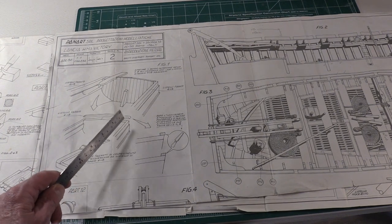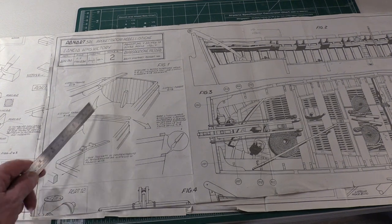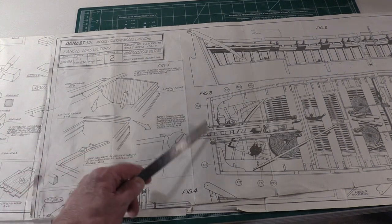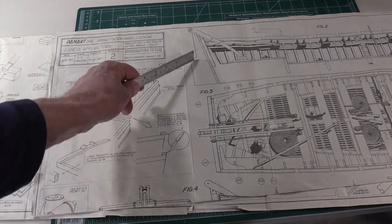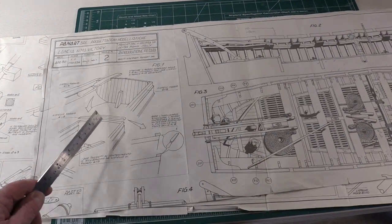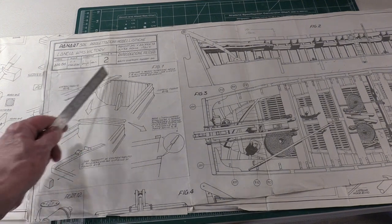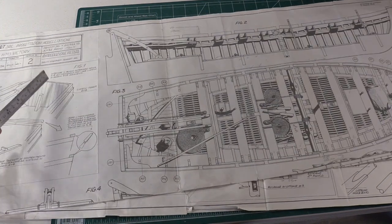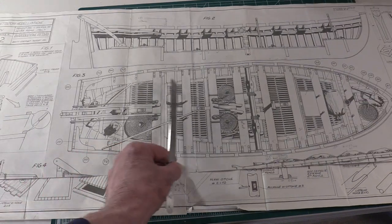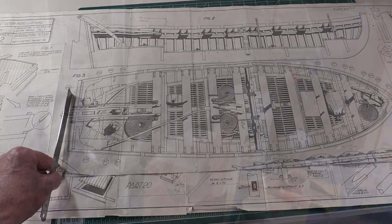I think I need to bend this top wood and get it cut and set before I put this on, because you file this to make it smooth. And I have to do this before I put the anchor winch on. Sequence has always been a little bit tough for me to understand, but I think that's what I'm doing. So my next step is to bend this gunwale wood and get it ready, and then start this rear preparation in preparation for doing this business here, which then I'll work from the stern forward, and that'll place this bench and this bench, and I might have most of my work done.